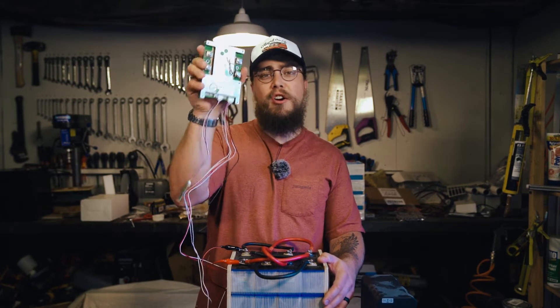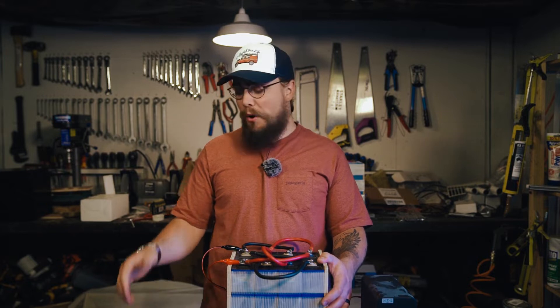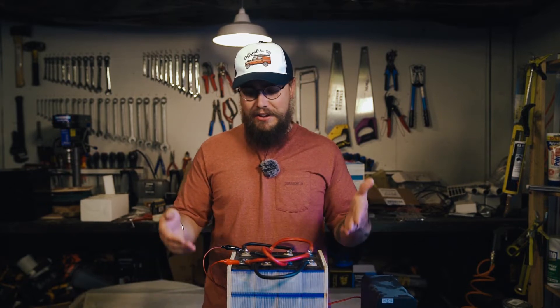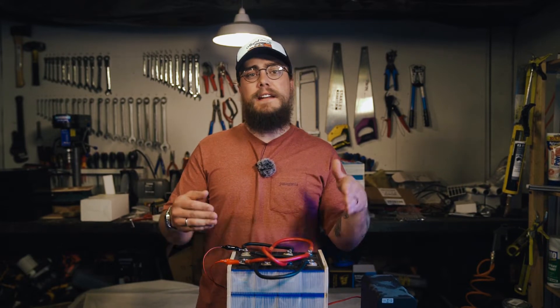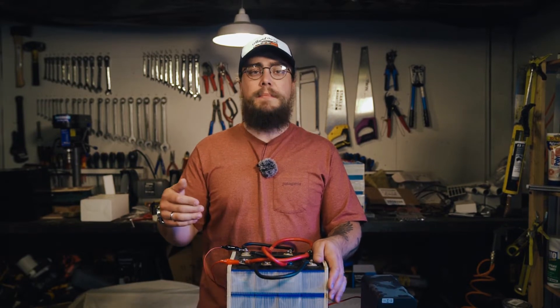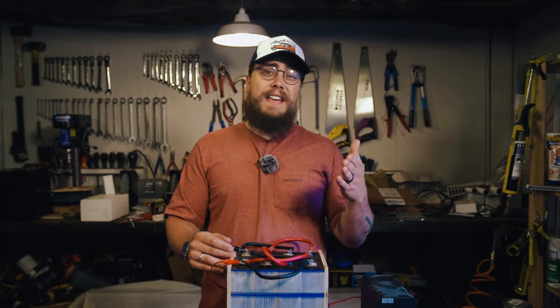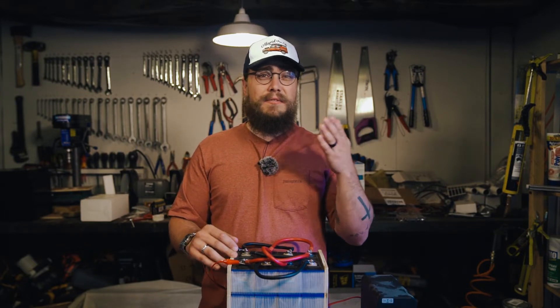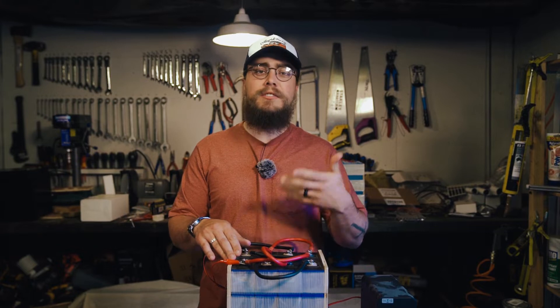It's finally time to use my overkill BMS that I've had sitting on the shelf for quite a while. I'm going to be building out a workshop battery. These cells are some that I bought to test - I made a video about it previously but they did not pull capacity. They were meant to be 200 amp hour cells and got something like 180, basically just short. They're probably Grade B cells that have been repackaged and sold as Grade A.